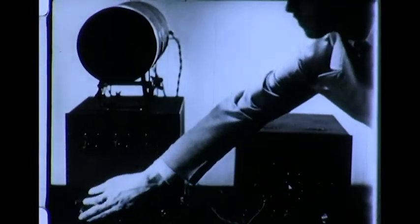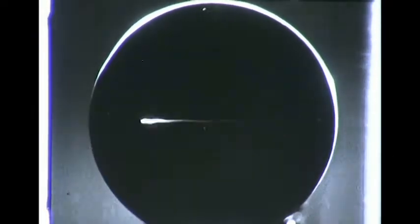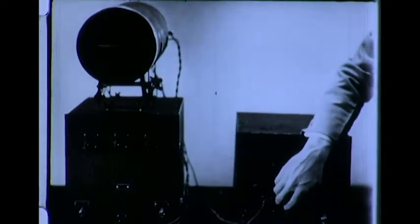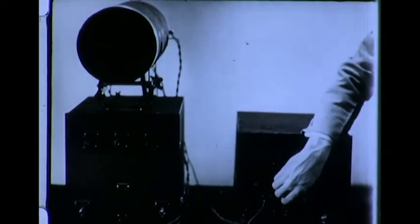With this device, called a cathode ray oscillograph, it is possible to see sound — to picture sound as we hear it. When the switch is turned on, a narrow band of light appears. As we make adjustments, however, we find that this light is not really a line, but just a little dot in a great big hurry. As we readjust the control circuit, the little dot travels faster and faster until, as it crosses about 120 times each second, our eyes deceive us into seeing a line.